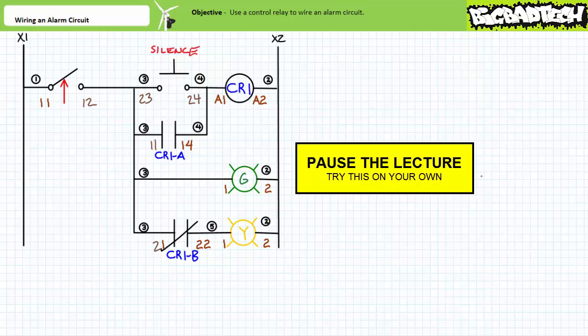Quick hint: wire numbers are best thought of as nodes. You'll note wire three is better thought of as a pooled connection, and only convenience dictates which terminal is physically employed to the best advantage. You cannot make this decision until you're actually physically wiring up a real circuit.